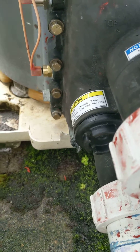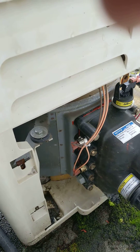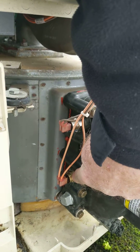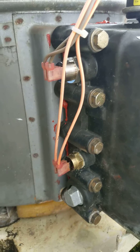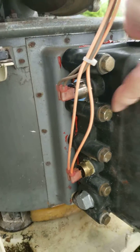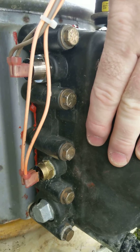We're going to remove that plug after we shut off the heater and the pool. Now, the way that we troubleshot the problem, we ended up replacing several things. This is the high limit switch, and it is in a position where it's normally closed, meaning these two wires are essentially connected by this switch. When it reaches a particular temperature, it opens the circuit, which tells the circuit board to cut off the gas and stop heating. This can go bad and be opening at the wrong time.